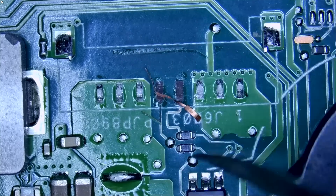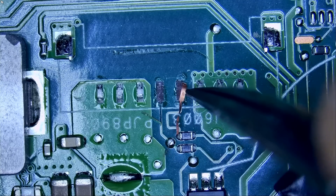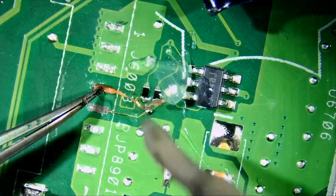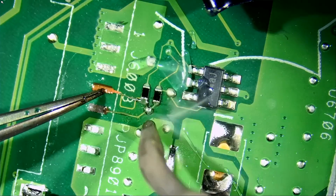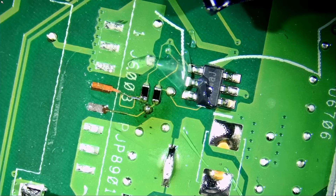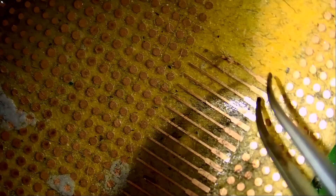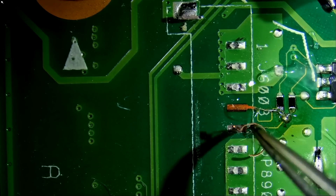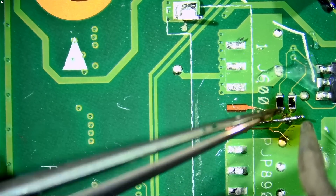It does not have to be that sticky. So this one we're going to run from here to right here. That pad strip was too close to the via for my taste, so I just pushed it back a bit. Everything is nice around right here. Now we're going to grab another pad strip and solder it right over here. Just like that.